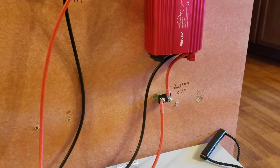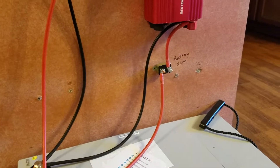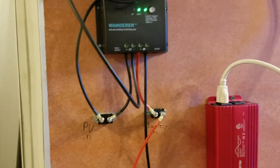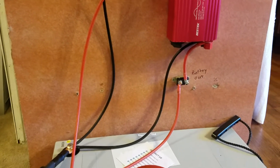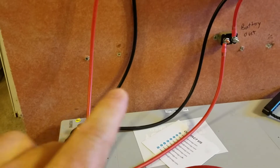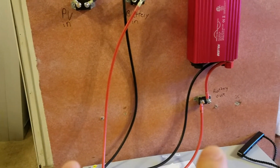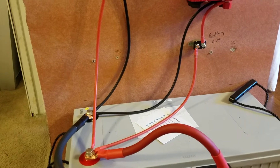For the inverter, I mentioned in the last video that I had these 12-gauge clamps and was going to do my own wiring. It really isn't necessary for this size of system. I don't need any of these breakers on a system this size — you could wire the controller straight to your batteries and inverter and just clip them on. It would be way cheaper and save a lot of time. I wanted to make this have at least the bare minimum components any larger system would have to be safe, mainly to teach myself. All these little wires are 10 gauge, which is a bit overkill — I could probably get away with 12 gauge — but I like to go slightly oversized as an extra safety measure.